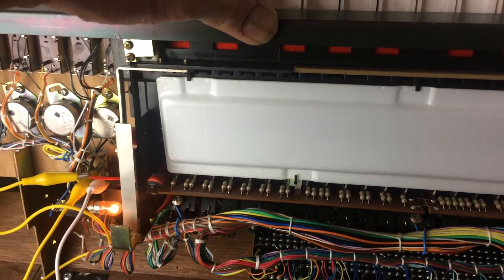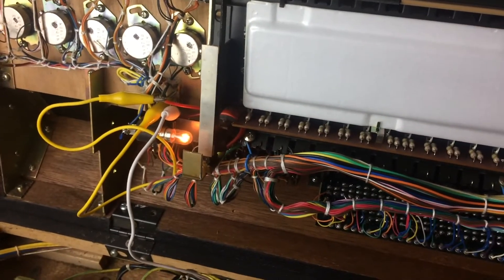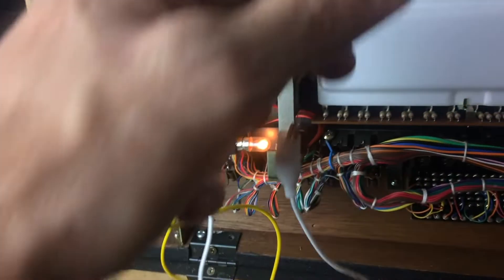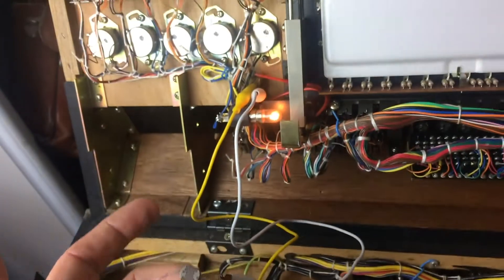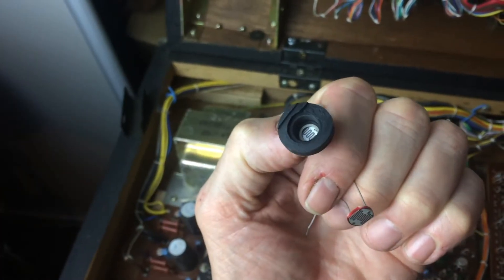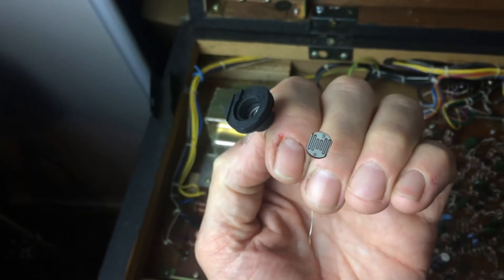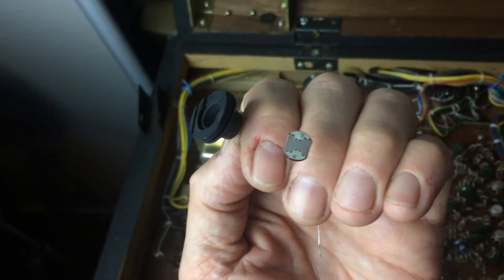I press down the key and there's no change at all to the circuit, so I suspect the light-dependent resistor is not working. I've patched in an external one temporarily. I'll play some notes and cover it to see what happens with aftertouch set to wah. Blocking it with my finger modulates the signal — so the rest of the circuit is working fine. The original LDR from the synth only varies by about 200 ohms, whereas the replacement goes from no resistance to maximum when I put my finger in front of it.